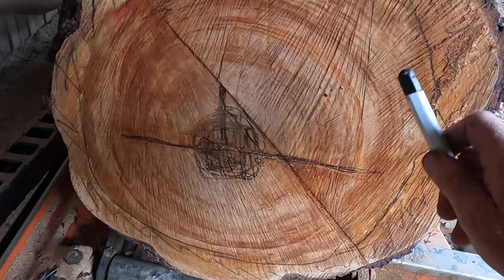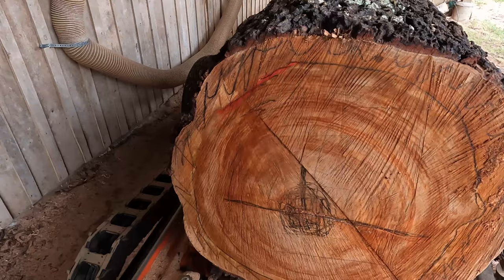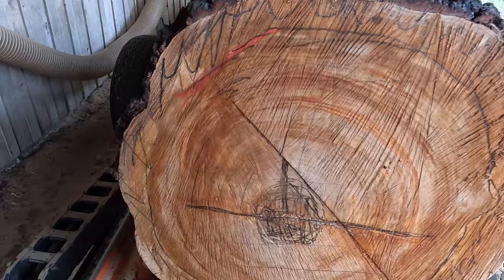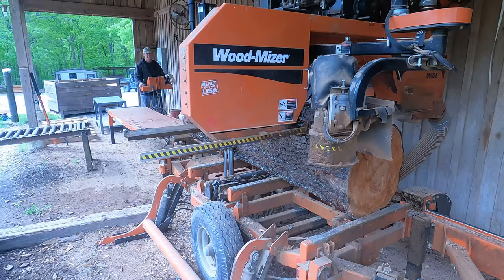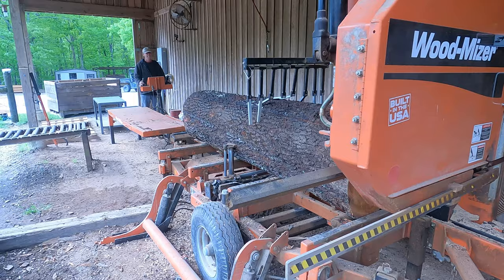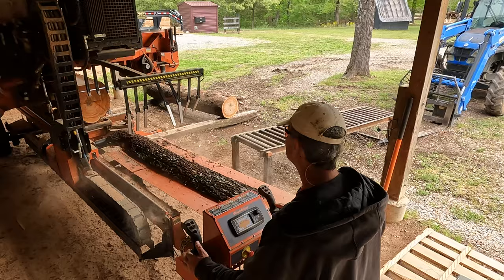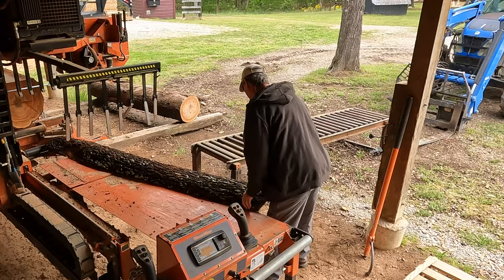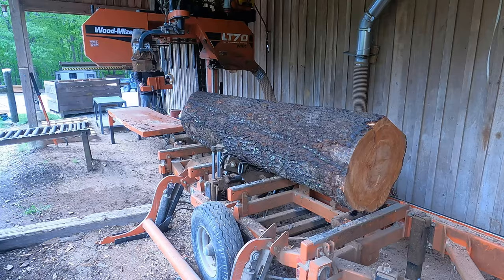It looks like a donut - edge right there, hole in the middle. I'm not sawing any of the undesirable wood and I'm not putting it into my lumber. I like to saw with a six-inch opening face - typically six inches of heartwood on one face for cherry. At this point I'm taking the outer sapwood off, taking a pretty deep cut trying to get a six-inch face in the heartwood. Watch how easy it is and how few steps it takes to get the slab unloaded off the outfeed table onto the roller table and then the forks. Gravity does the work.